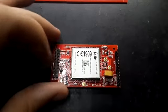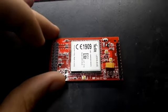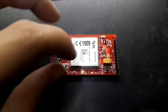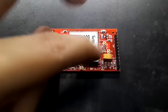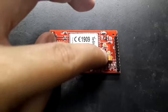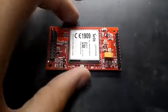This is a four-layer board for the GSM radio cell phone connection. It includes a GSM module with GPS. It has two antennas for the main GSM — one is the main antenna, the other is a diversity antenna for having a better signal. The other one is a connector for the GPS antenna.